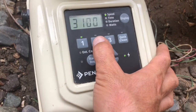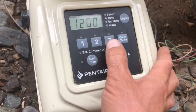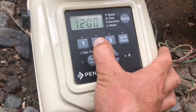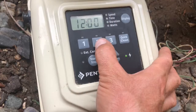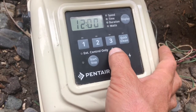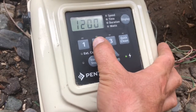Now you're going to jump over and hit the number two button. That number two cycle is going to start right as that number one cycle ends, so this is probably where you're going to put your low speed in. You're going to do the same thing — cycle through with that number two button, set that speed, set that duration, and then you are good to go. You can even do number three if you want to and have three different speeds, but remember, these piggyback off of each other.